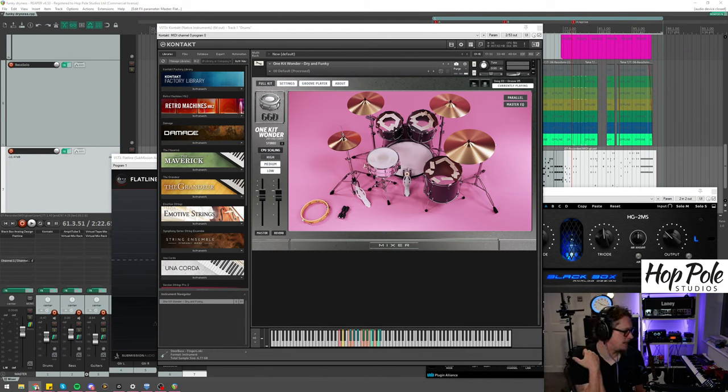Even the ID14 and the ID44, which is Audient's flagship, have really good direct injection interfaces, but I still won't use them. It's force of habit at this point. It doesn't necessarily separate electrically through a transformer, as Danny says. That is generally what DI boxes do, especially passive ones. It's usually just a big fat transformer, but a passive DI box and a passive guitar, which is most guitars, don't get on well with one another because they electrically fight each other a little bit, which makes it sound a little dull.